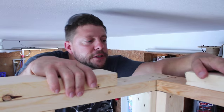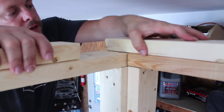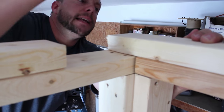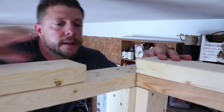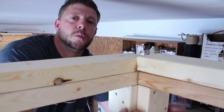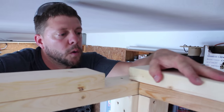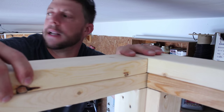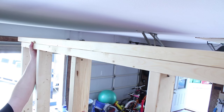As you can see, the two corners meet here. You want to pull this top plate over to overlap. What that does is give you your structural integrity from this wall to this wall attachment. If you were to put the two like this, there's nothing really holding these two walls together except for this line of nails down here, and that's not what you want. So you want to roll it over, overlap, and you butt this one in — that keeps an overhang for your next wall down in there, which you can see on the camera.